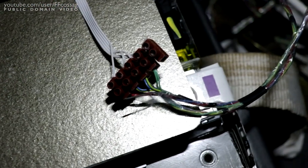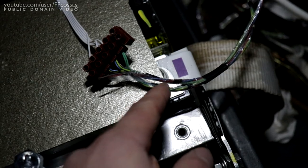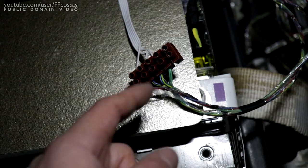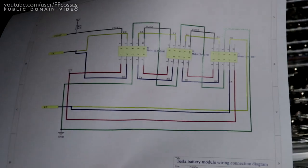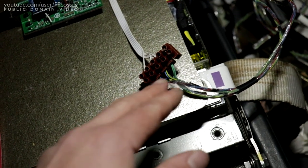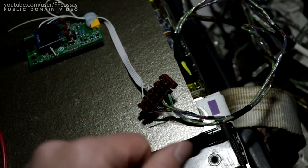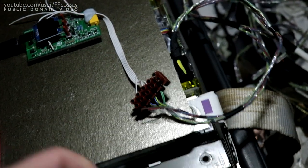And I've wired this up as best as I can. You have these two looms come from each end of a pack, and one end of a loom becomes, as far as I've figured this wiring out, courtesy of whoever made this schematic thing, this is how we got it to work before. I've quickly, hastily wired it up for this setup. So we have yellow and blue from one end is our TX, yellow and blue from the other end is our RX, and there's like a 50% chance that you get those right.